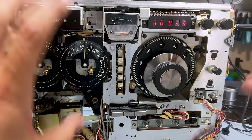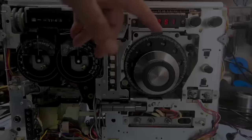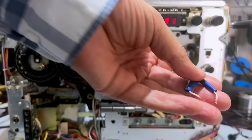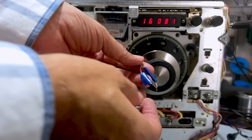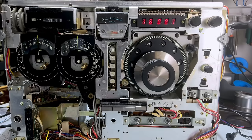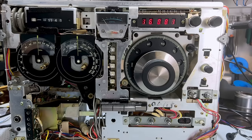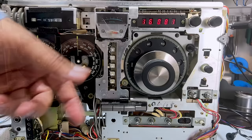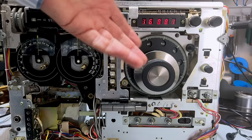While I wait for this thing to be naughty, the dial lamps on this thing were very, very dim. So what I decided to do was replace them with LEDs. This is the lamp they had on there, and this is actually the insulation tape they put inside the radio. There's a lot of loose wires at the top, just as a result of somebody replacing dial lamps and not doing a good job at all. I removed the shortwave dial lamp and I've replaced it with an LED, but I've done it differently to what others have done.